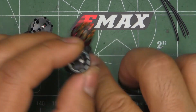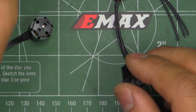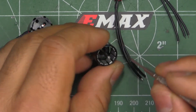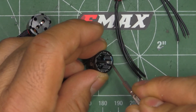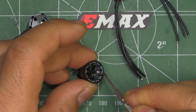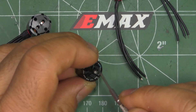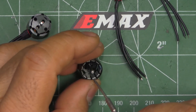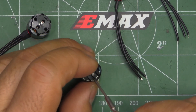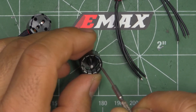One other thing I noticed, which is not very common on these size motors — actually, I think this is the first motor I've seen using balancing mud right there. You can see the blue epoxy — it looks like they actually went ahead and dynamically balanced these bells. That really shows how Emax is very concerned about quality control in their motors. Balancing these small motors is the first time I've seen it.